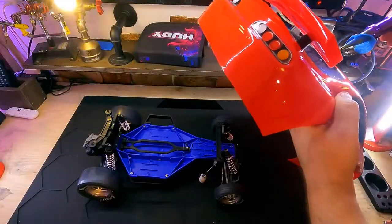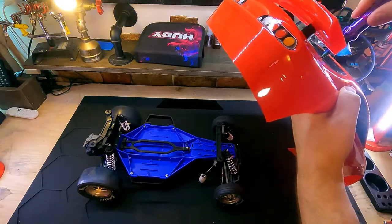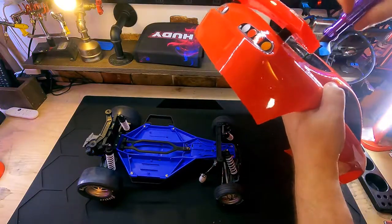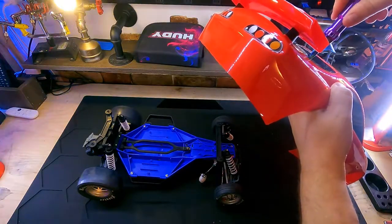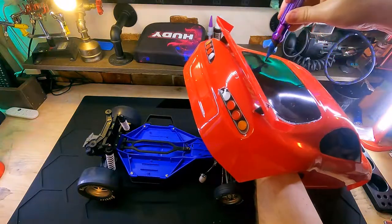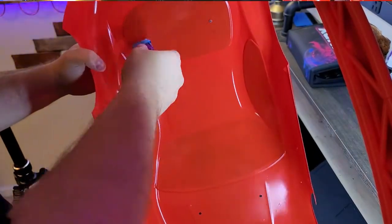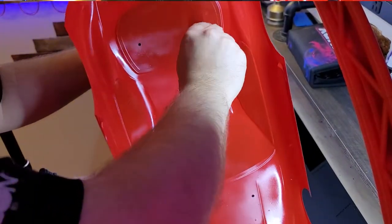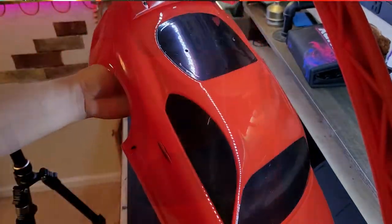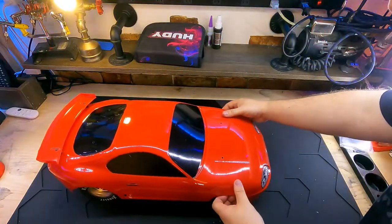So now we can start drilling these back posts using our guide hole that we had from before and cutting almost down to our plunge depth on our little tape gauge there. Before flipping over to finish the drill. Now that those are all cut, we can test our fit here and see how we did.